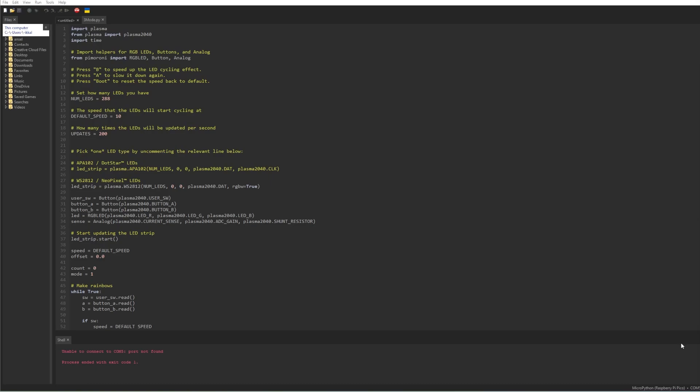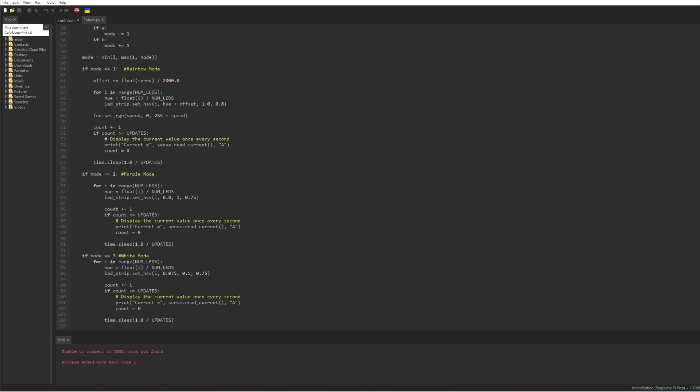As I've switched to an RP2040-based control system, I'll be doing most of my programming in Python through Thonny. There are libraries which make it very easy to generate PWM signals to drive servos, so I don't think that will be a problem. The main control challenge will be tracking the positions of the fingers relative to the home position — I think I'll need a counter for each finger that approximates angles based on the time the servo is moving at a given speed. I believe I can also configure the homing switch pins on the Raspberry Pi Pico as interrupt pins, which would mean the system can accurately re-home whenever the fingers naturally reach their end point.